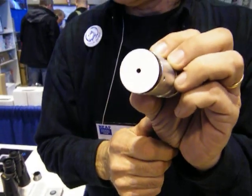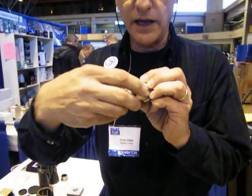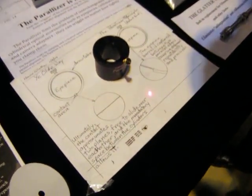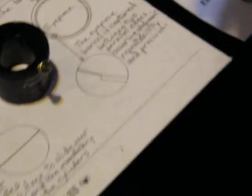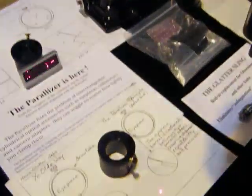Can we show the beam impact? Sure. Here's a typical laser diode collimator beam impact shown on paper. As you can see, it's elongated and a bit fuzzy-edged. Now I'll turn it off and install the one millimeter pinhole stop — an attachment that comes with all of my collimators. And we'll take a look at the beam impact again. It's a tiny circular spot, and this aids in precision when making single beam adjustments.